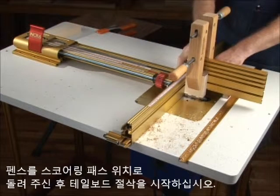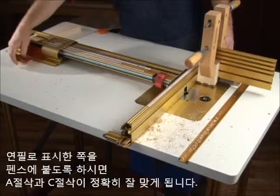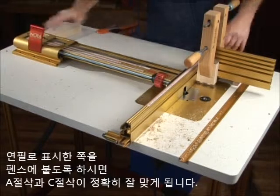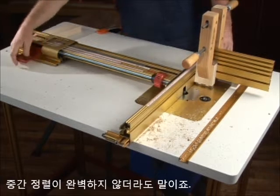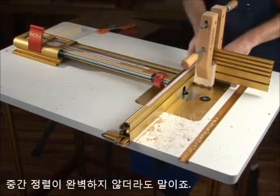After completing the cuts, immobilize the right angle fixture and flip the stock. Again, pencil edges against the fence. Always press the pieces down and against the fence before securing to the right angle fixture.